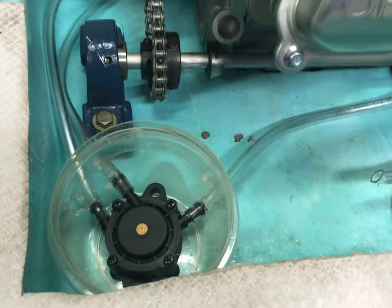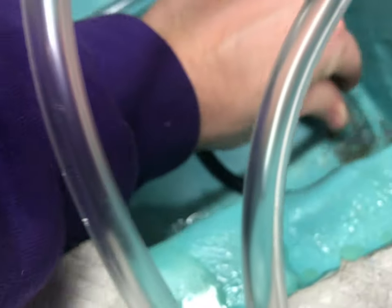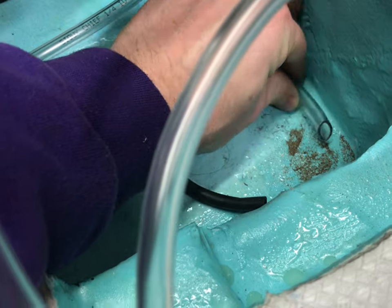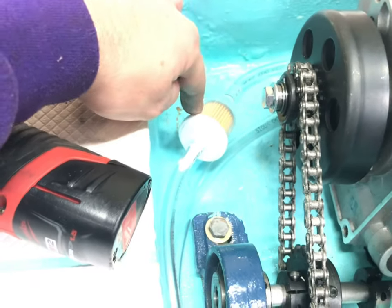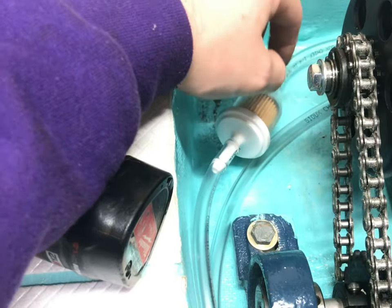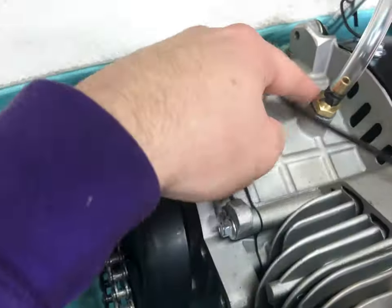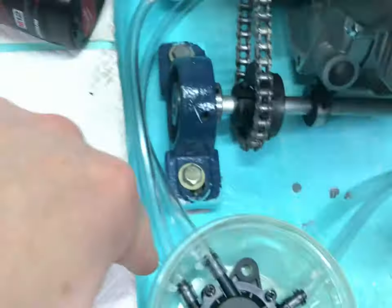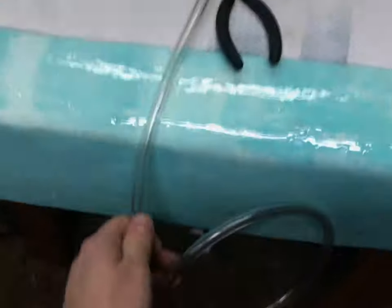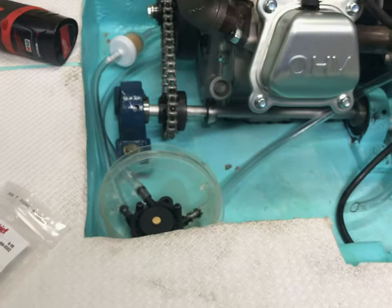Okay, so this is what we're looking at for the first layer of the water pump. So, some tubing, let's follow it. This is the intake. That's where water will get sucked up. It'll go around the engine and then through this filter. I'm hoping it just catches dirt and sand that might get in there, and I can always clean that out if it gets clogged up. So that comes through here. The pulse pump will come from the engine block that loops around and back. And then the output here will just come up and out the side of the unit, and all somehow attaches so it's out of the way. Okay, let's get back to the fuel line.